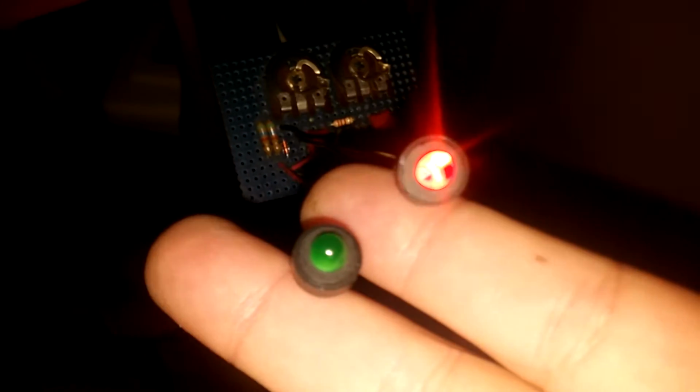So then this goes over to this interface here. This connects and runs a pin into the COM port on the computer, the old DB9 COM ports. There's a couple of LEDs for transmit and receive on here as well. You can see those as the radio is now transmitting. That light is keyed up, and if I were to key up on my handheld here, it would transmit. This radio would receive the signal and then put it out through the internet as well. That's handled through a carrier operated squelch line that also connects into the back of this old computer here.